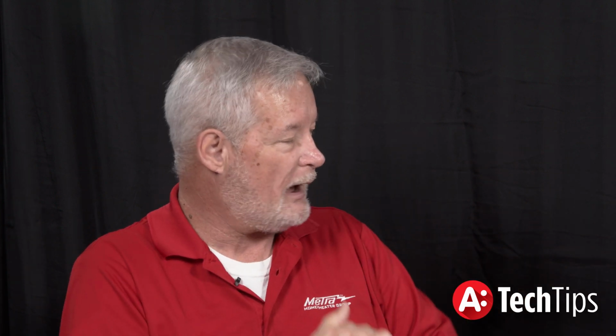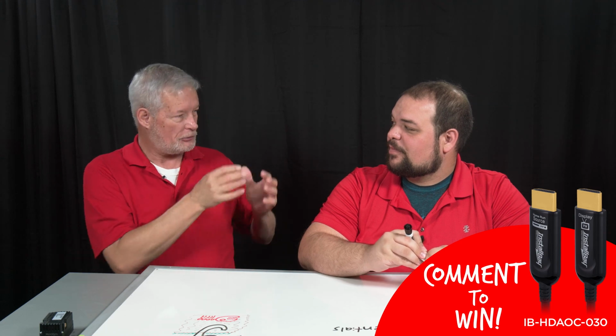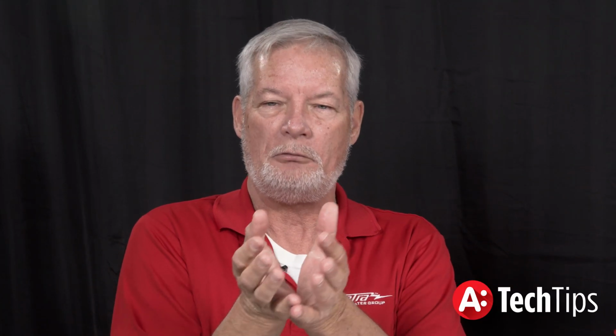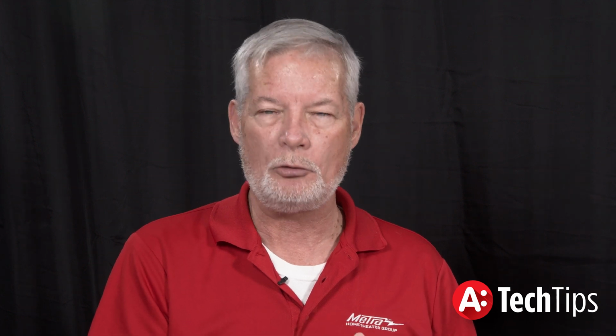Now, you're a rack master. Do you ground your racks? I don't know about a master, but yes, I do. So making sure that you ground the entirety of the rack to the power supply that's in the rack. Definitely. Just because it's not connected to the power does not mean it's not connected to the ground. All the metal chassis, the screws, anytime you have these pieces touching metal, it becomes part of the circuit. So absolutely, you do want to ground.